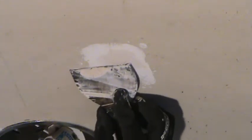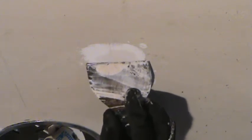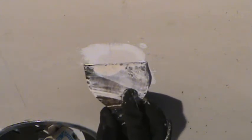And that's a little patch that I put the webbing over, just a small little hole up in the ceiling. At this point, before I put the next coat on, it's still drying and it's almost dry all the way. But even after it dries, or just before it dries, a little bit of mud has peeked out through the webbing tape. And I can just gently knock that down, scrape it down just a little bit, not very much.